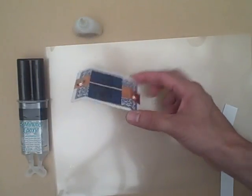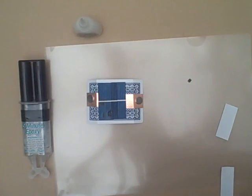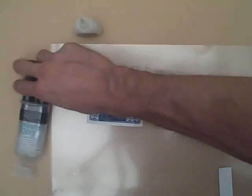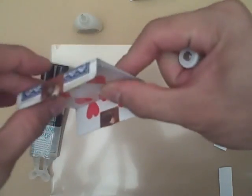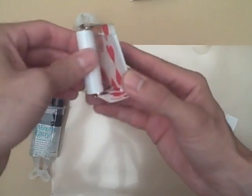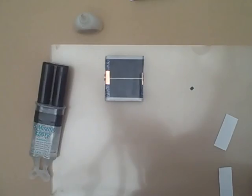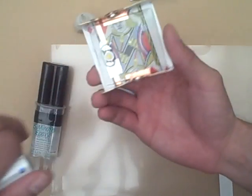You're basically done. The last step is you can add some encapsulant — you can use five-minute epoxy, or there are new encapsulants coming out with the Solar Pocket Factory DIY kits. Zooming into a complete version, at the bottom I've added a scrap piece of acrylic to make this more rigid. So now I can really just snap in the battery and not worry about my solettes fracturing. Then I'll just lay this in the sun and it will recharge my battery.